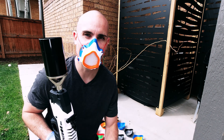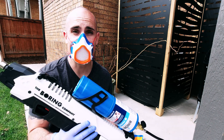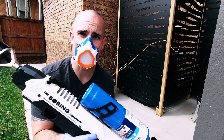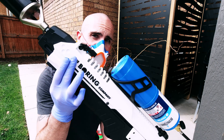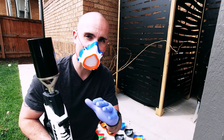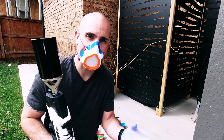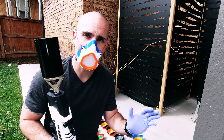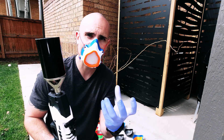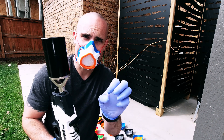Obviously using a flamethrower isn't the most practical solution — and in fact, this is not a flamethrower. This is a DIY replica that I made myself. I'll drop a link in the description. I even 3D printed the Boring Company logo on it. The point is that heat can actually melt the material enough to get rid of stringing. You do have to be careful because too much heat, especially with PLA, can cause the material to collapse and melt.